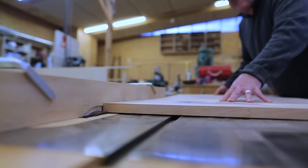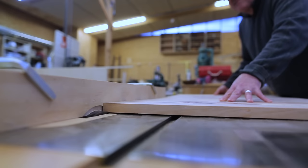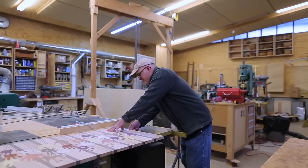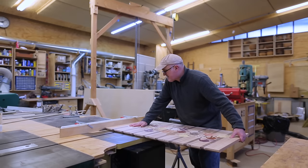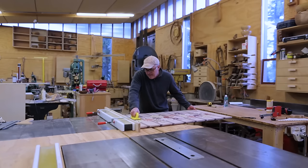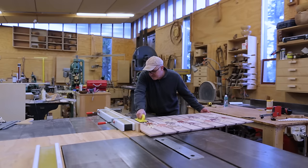To hold this piece in the frame, I think I'll make a rabbet all the way around the edge, and a groove or dado in the frame that'll hold that edge of the panel — just like a panel door with a panel in the center. With all of this side grain on the art piece, it's going to expand and contract along its width quite a bit, so it needs to float within the frame.